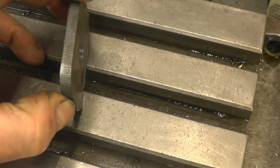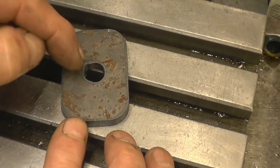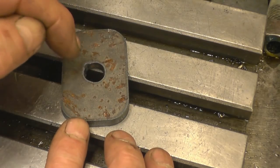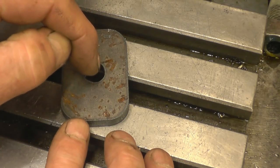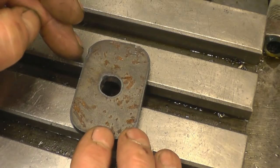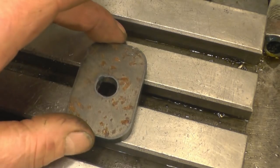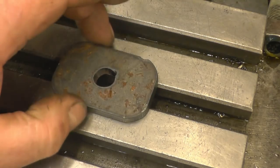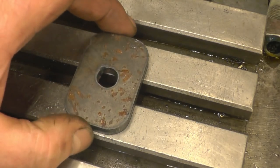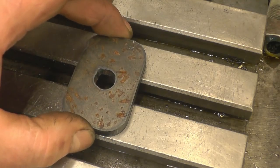That's the spacer or washer — it's actually on 8mm plate. The faults I've got: you can see where it pierced the hole in — it started to burn the hole in, it puts the pierce in first. I should have had the pierce further into the centre so it wouldn't have been seen, and on the outside edge it should have pierced on the outside of the line, not the inside. So basically they're both the wrong way around. Like I said, it's quite a lot to learn. I'm not getting that much time on it because it is bloody freezing out there, but it took probably two or three minutes to draw it and 30 seconds to cut it out.